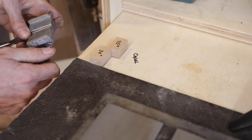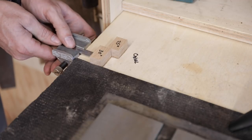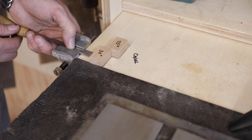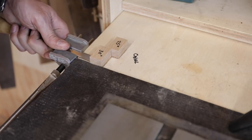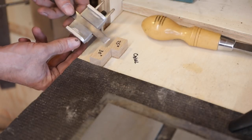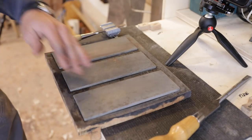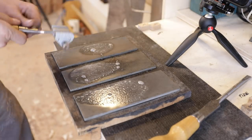When I slide the chisel in, it's got some teeth that bite. I can freehand it but I sometimes have better luck doing it this way. If I'm going to sharpen my chisel at 30 degrees, I preset those little wooden blocks and slide the guide until it touches, then tighten it up with a screwdriver. That predetermined setting sets the depth for my angle so I get the exact same angle every time — that's really the hardest part. I've got diamond stones: coarse, medium, and super fine.